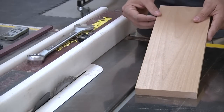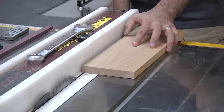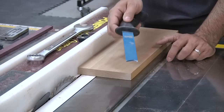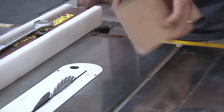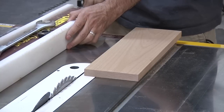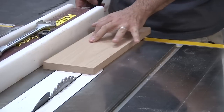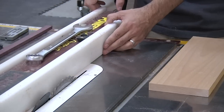Now let's say you want to cut some quarter-inch strips for edge banding on plywood. It would be great to just set your fence for a quarter inch and start making these cuts, but if you've ever tried this you know how dangerous it can be. You could use a push stick to fit between the blade and the fence, but that scares me. Usually what you wind up doing is adjusting your fence so you're making the cuts on the outside of the work piece — but then after every cut you need to readjust the fence to get a quarter-inch fall-off piece. Cutting thin strips like this is probably the most frequently used thing I do with the Gripper.